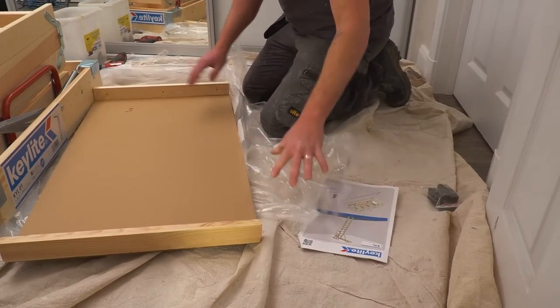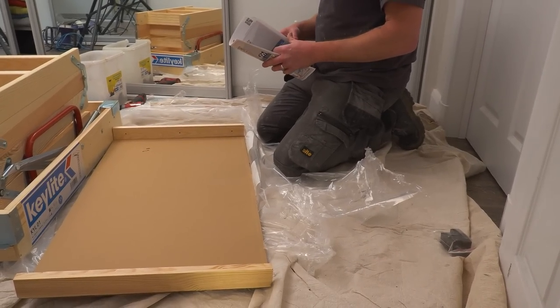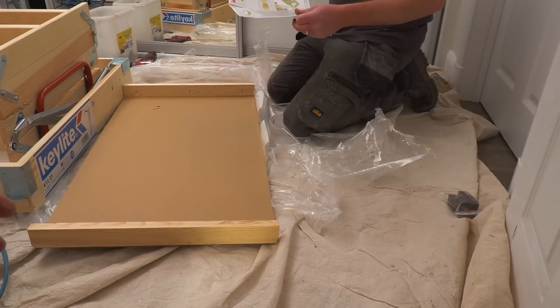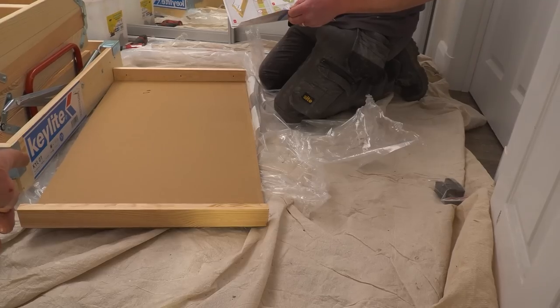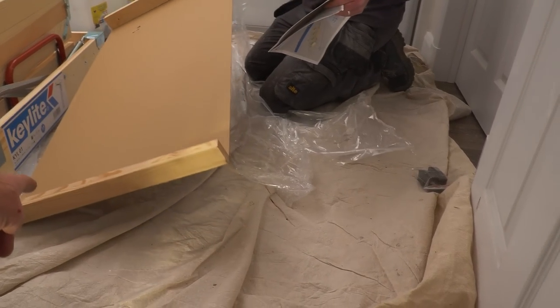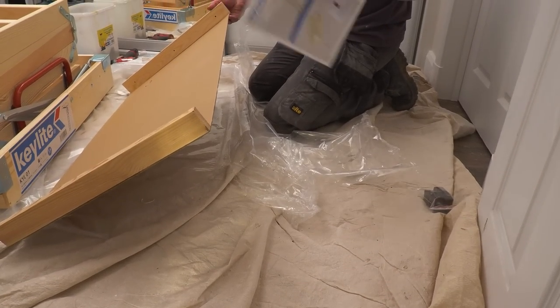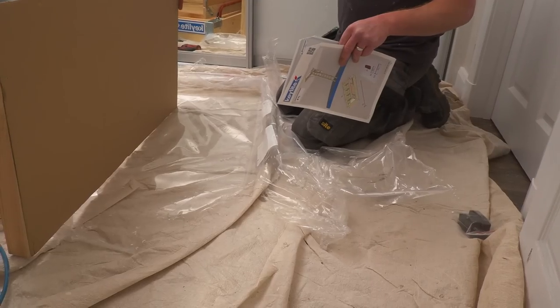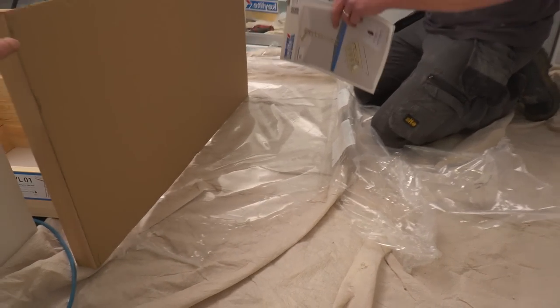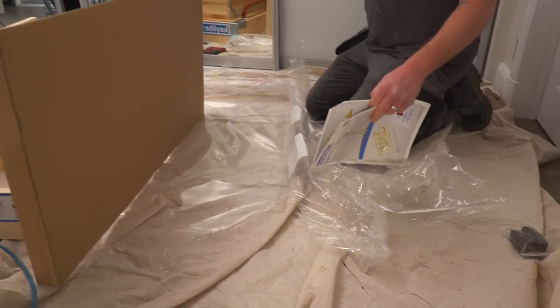Why would they staple that on? Well, before I take it apart, I might have a look in the instructions. Yeah, I can tell you something about this. That's actually the footprint of the loft ladder. So if you now put that up into your opening, those two battens should fit exactly where you want them to fit. Do you see what I'm saying? And this is nice and square. So if that's flush with the bottom, then those two battens are automatically where you need them.